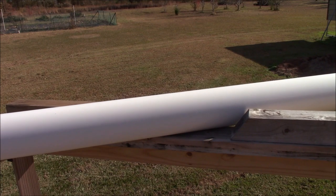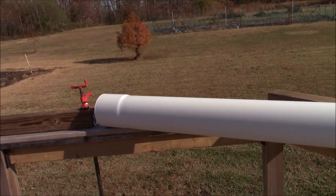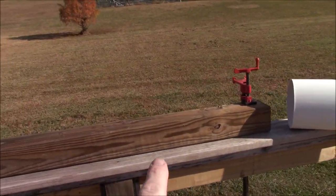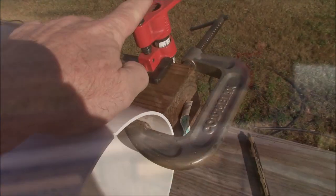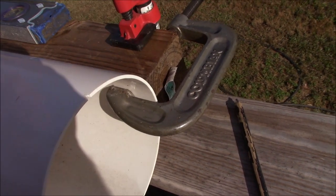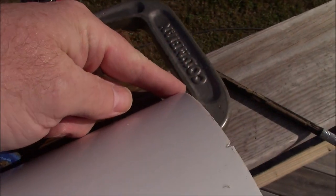The first thing I need to do is draw a straight line across the PVC. With a rounded form that can be difficult, so I took one of my 4x4s and clamped it down onto the edge here. I put the pipe against it to draw a straight line. After clamping the 4x4 on, I clamped the 6 inch PVC to the wood itself. There's a little bit of a gap, so I take a level, let it rest, and tilt it up until it makes contact. Then I draw a straight line all the way down the length of the pipe — exactly the same place on either end.